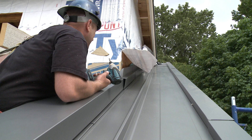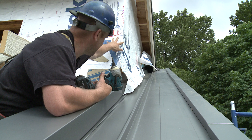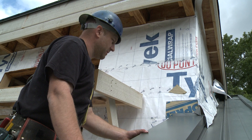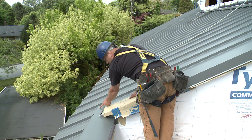Does that Tyvek need to be underneath it? No, it'll be a little shingle on top of it. They'll just have to put another strip over top of it so it can get proper water shed. So it's all good to go now. I just have to put a four-inch flange around here, and then they lap onto it again with their paper membrane. Then I'm going to complete the end of this boot where it ties in here. It's a bit of a tricky piece — a bunch of angles to measure. We're going to put a standing seam on this side to divert water, and then just tie this in. Makes a lot of fancy cuts and makes it look good as well as be functional.